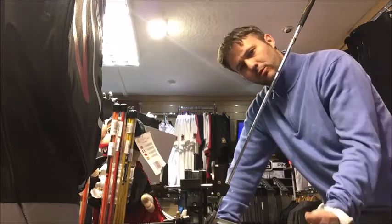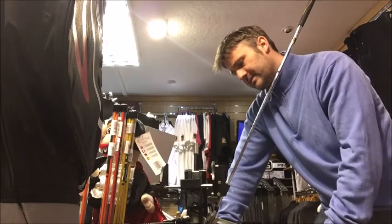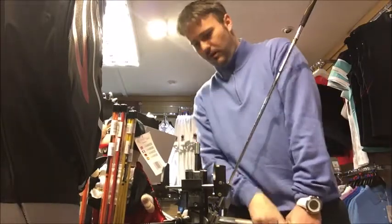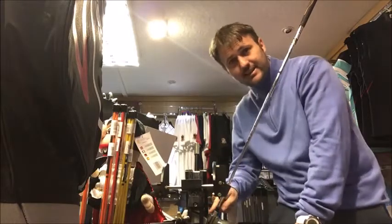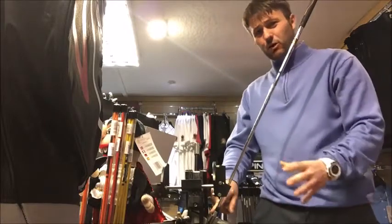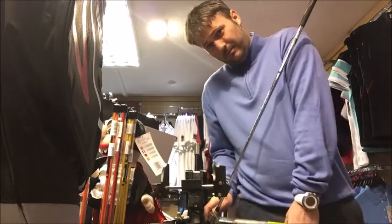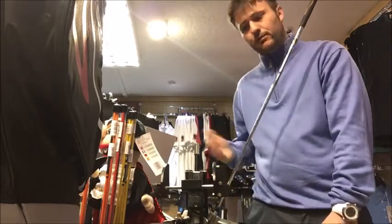Alternatively, if it needed to be more upright, you know, potentially more upright clubs are for people who are a lot taller, that's generally what you tend to find. What I would have done is I would have stood a lot closer, I would have placed all my weight onto the bench, I would have then used the club here, made sure that I held it as tight as possible to the neck. That is key and paramount, because if this starts going up and down the shaft, we can get it wrong, and we can do something called goosing, which would bend the sharp end, the neck of the club out of shape. From that position there, I would then apply the pressure, lifting upwards in this motion here, which again would have obviously made the club more upright.